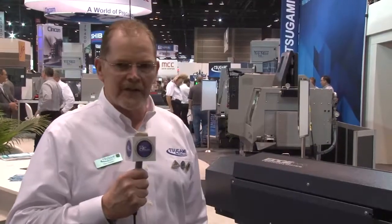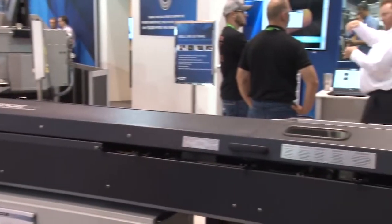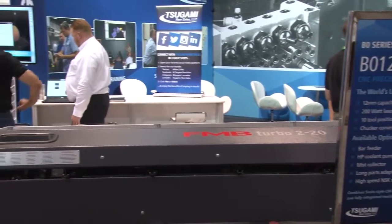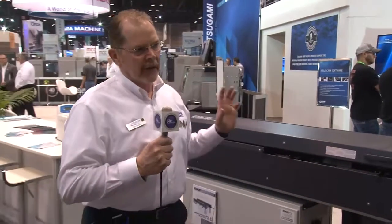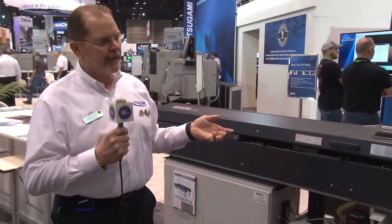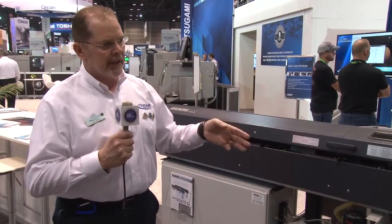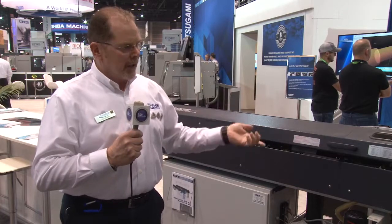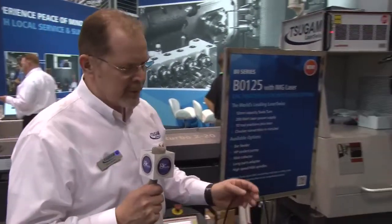Here's our entire system, starting with the Edge Technologies FMB Turbo 220 coolant-through bar feeder system. What this allows us to do is — we're loading tube — we're able to get the coolant all the way through the length of the tube, which creates a very clean part. We take the dross right out of the metal, and it also provides for a very burr-free, clean cutting condition, as well as the opaque coolant prevents back-wall striking on the part. We worked with our partners, Edge Technologies, to develop this particular system.